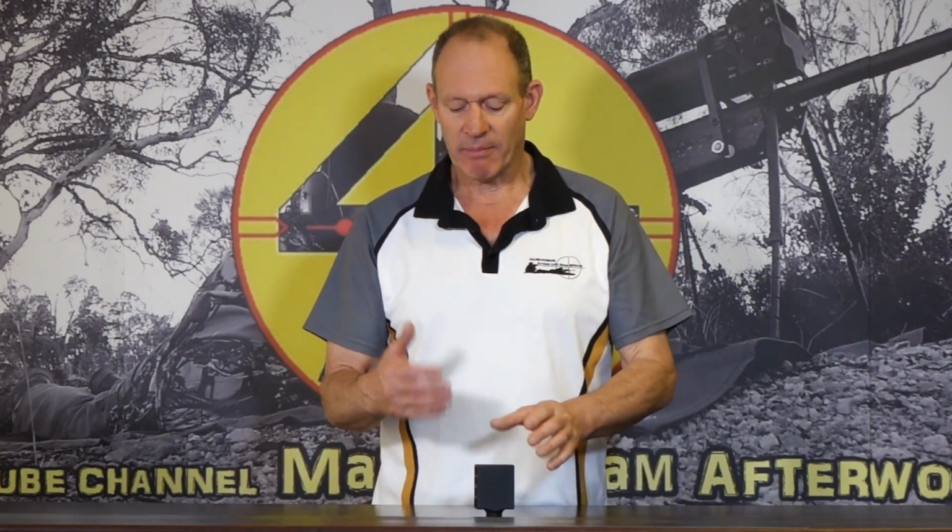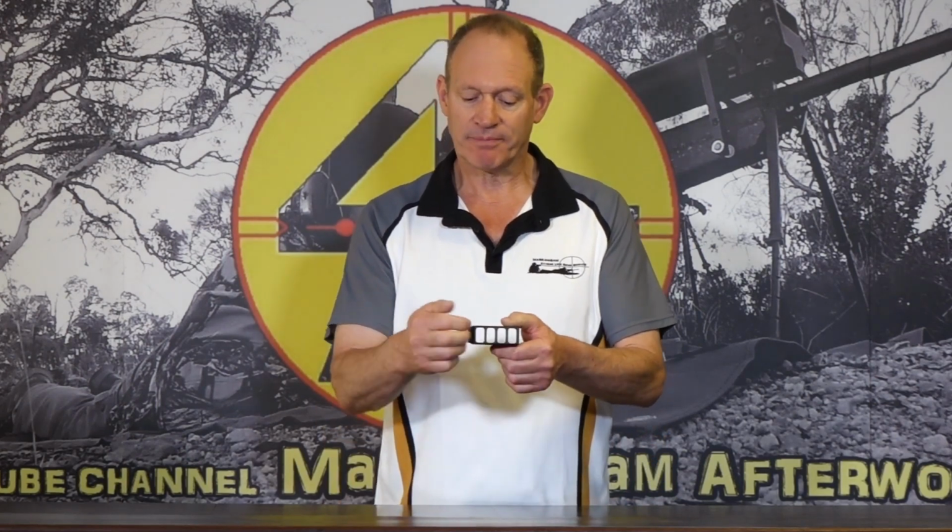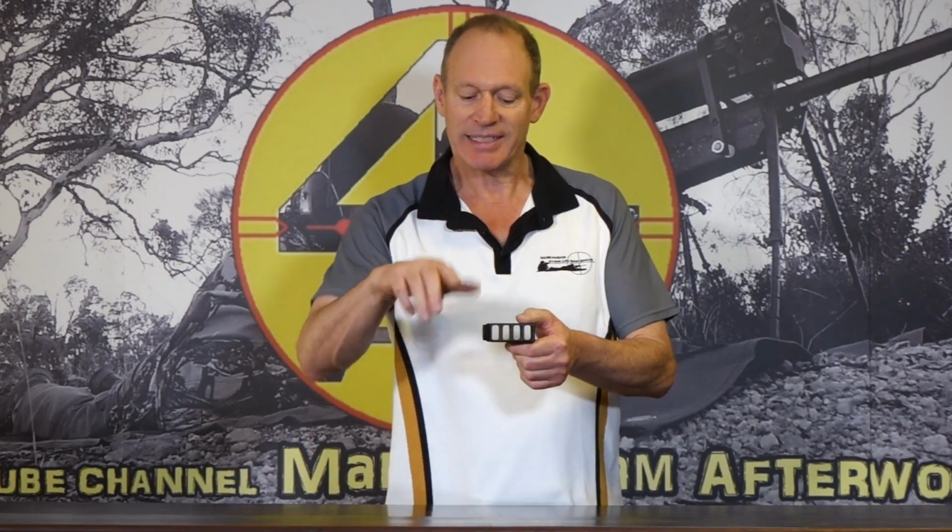The last feature that I found over time, and really more by circumstance, was how the muzzle brake cleans off the turbulent air from the front of the muzzle. How it can actually do a better job than even an open muzzle with the right sort of muzzle brake. And by having these big open ports, it really does a good job of cleaning off that turbulence that's trying to get in front of the bullet, because it actually has a place to go with the big ports and it's not getting pushed anywhere other than straight out. So that was the design of what I came up with.